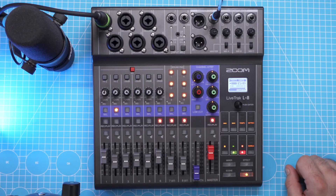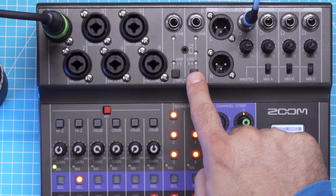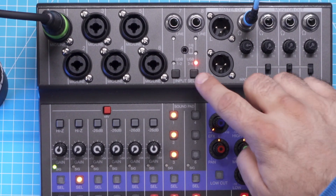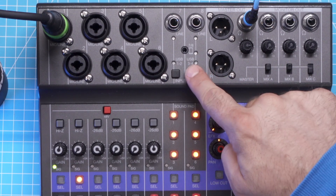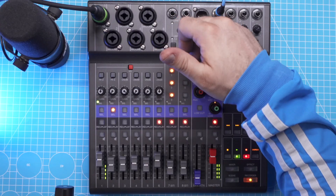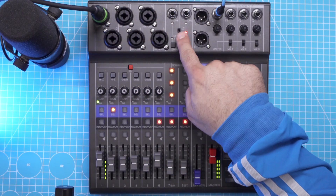The pads are buttons where you can load pre-recorded content and launch it from there. Input eight is where you also have the TRRS phone connection. You can select to use that as a source, or as the second USB loopback, the sound pads below it, or as a line input — though you would most likely use it as a phone input. This is where you get the built-in mix-minus: whatever comes in from the phone you can record, and whatever comes into the mixer will be sent back to the phone minus the phone itself. That's the mix-minus.